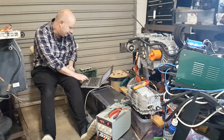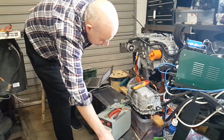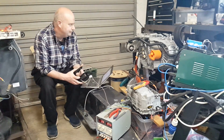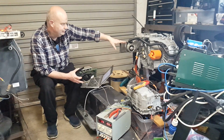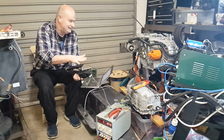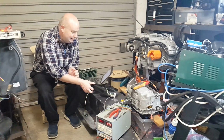Let me show you what happens. I'm going to stop that inverter, and I'll run it in closed loop mode, or at least try to. So that's closed loop mode. Grab the throttle pedal. As I push the throttle, you can see it jerking back and forth a bit. The whole assembly shakes. I can start smacking the throttle like this, and we can get it to jump around the place a bit. But that is about the best that I've been able to achieve so far.